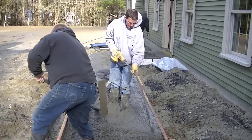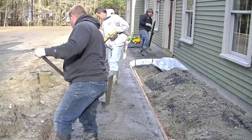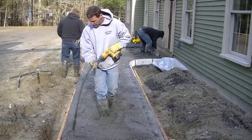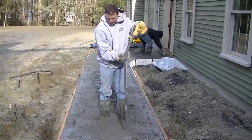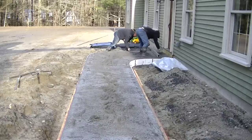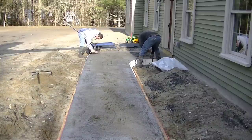Again, if you need help, I'll have my link down in the description for you. If you have any questions, leave them down in the comments — I'll try to answer them the best I can. If you're thinking of doing some type of walkway, this is part one. In part two I'll show you the type of finish we're doing. Probably the easiest to do is just a simple broom finish — cut some grooves in it with a joiner, put your edger on it, and then a light broom finish. But there is a little bit of a trick to getting a really nice looking broom finish on these.